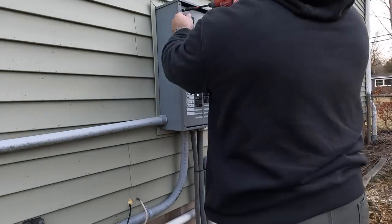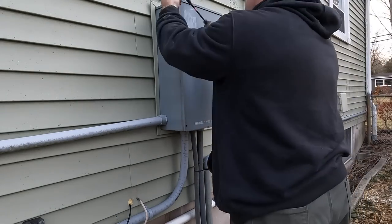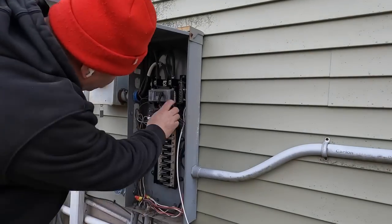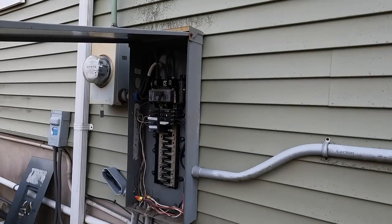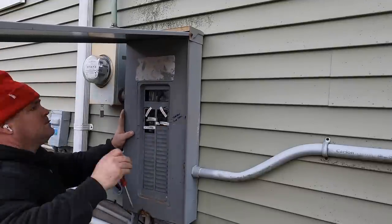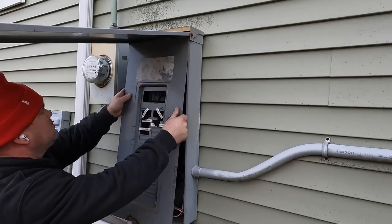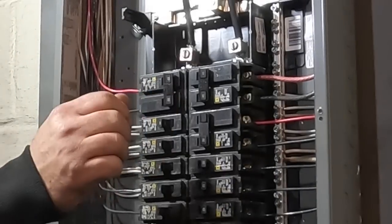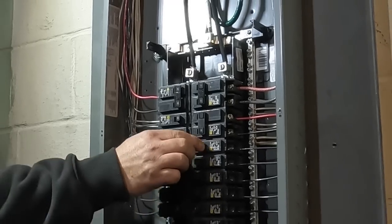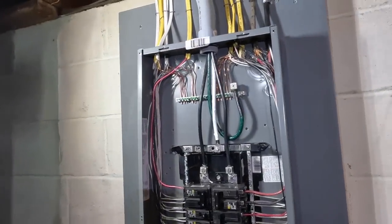I terminated it to the existing 60-amp circuit breaker that was already there, so there's 60 amps going down to that panel — sized in accordance with the generator. But in case we ever want to upgrade, the number-two aluminum good for 100 amps is in place. That wire I had connected to the main breaker panel was a temporary feed for a freezer in the basement and a couple of sump pumps that the owner was concerned about, so we gave them temporary power. This is an old 200-amp NEMA 3 panel, and I had a hard time getting the panel cover back on. Now the power's been restored — this is the final product.